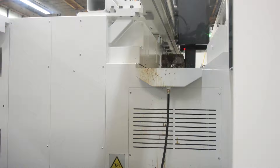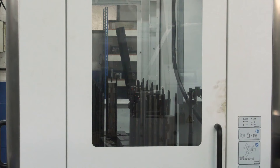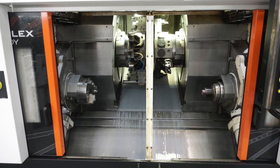As you can see, the gantry itself is kept enclosed within the machine. We either have a pitch feed conveyor or a rotary feed conveyor. The rotary feed conveyor lends itself to parts that we can stack; the pitch feed conveyor lends itself to prismatic parts. So what's happening in the machine itself?